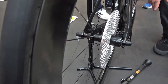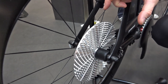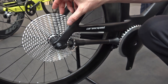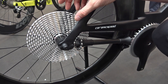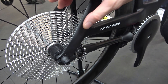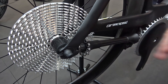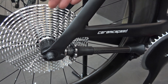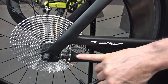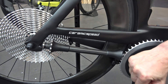This is a 13-speed cassette. Another advantage of this system is we are not bound by the width of the cassette. When you ask how many gears can you fit into a cassette, it depends on how wide it is and how skinny your chain is. Because we shift in fore and aft rather than inboard and outboard, we just chose a 13-speed cassette. We could do 14, 15, 16 — the only limiting factor is how far this pinion moves, so we could put 20 speeds in there if we want.